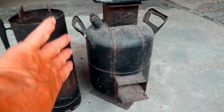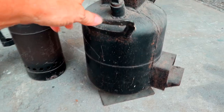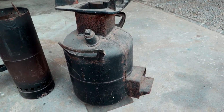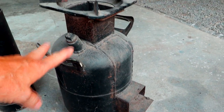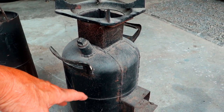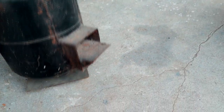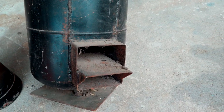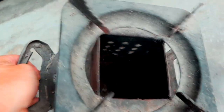I'm going to skip the next gas fire and bring out the rocket stove. There's nothing wrong with the rocket stove — you've got your gas fire guys and your rocket stove guys. This is just a rocket stove like many. It's made out of a freon tank, not a propane tank — a freon tank. This freon tank is better because it's taller and less diameter, and when you're making a rocket stove, taller and less diameter is good. The way it works is like any other rocket stove. There's a little channel in there — I believe it's a four-inch tubing going in, and another four-inch tubing that comes up. There are no holes at the bottom.